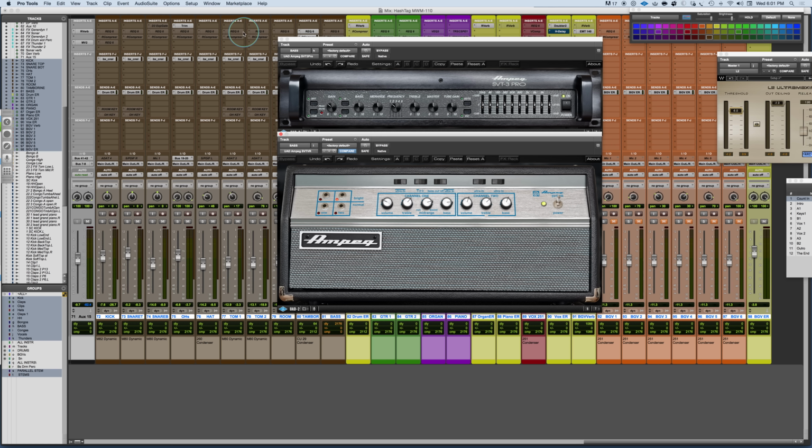What you have is a number of basic features. Volume, which is pretty explanatory, so this would be like an output volume. You have a treble control, mid-range control, and bass control. Some of these settings work in conjunction with some of the features up here. For example, if you boost the treble, normally it'll boost at 4 kilohertz, on channel 1 or channel 2. The treble control will basically do the same. And this boost switch, or ultra high switch, when engaged, enhances that effect.